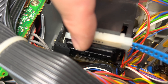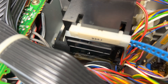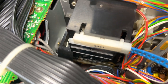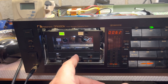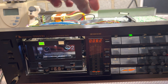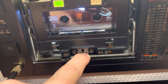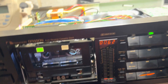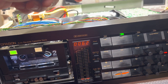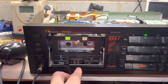When I was using this pro tape, my azimuth was going 30 to 50 degrees off in both directions when rotating — wow — and it's pretty hard to catch. So I'd recommend: if the azimuth in two directions goes too far, try to adjust the middle screw on the playback head a little bit left, then right. Make one click, see where it goes, another click, see where it goes, and finally you can get it close to center.